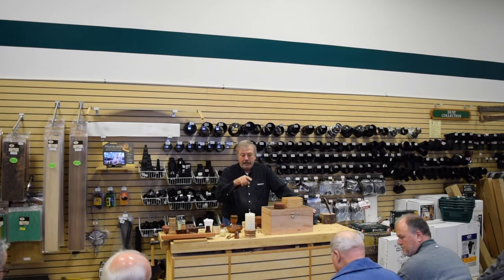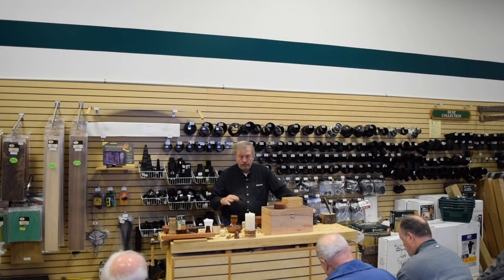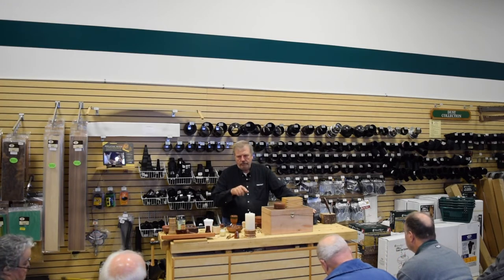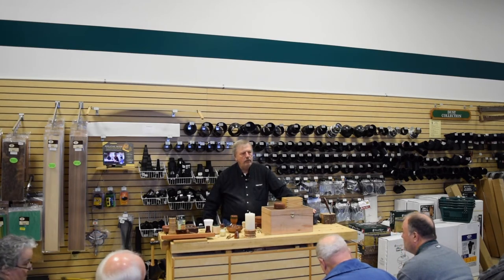For a cutting board like that you're actually going to cut on, you want to use a mineral oil and wax combination. Slap it on, and anytime you clean it with soap and water, dry it off and put a little more of that mineral oil and wax on there. The mineral oil keeps the wood from drying out. The wax keeps the mineral oil from evaporating as fast as it does. Just make sure you keep recharging it. You never want to put a film finish on that, because if you do, you're going to have those white lines and it's yucky.